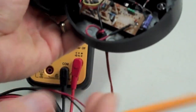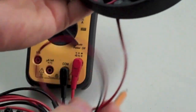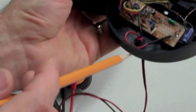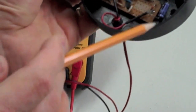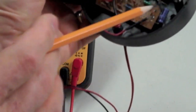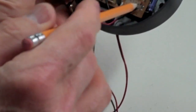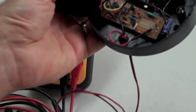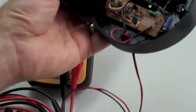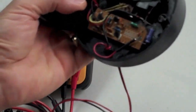board. Now, first thing you want to do is cut off that wire that has the string of 50 and put in a red and black so you can know what the polarity is there, and just connect it where it was connected before. But before you put that in, put 2 little diodes on each line with the flow going in the right direction for the diode. I used silicon switching diodes. They're 4148s.